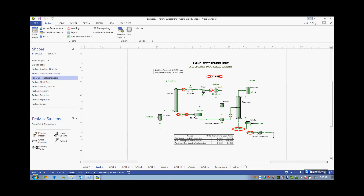Next, we have the steam and the lean amine, which are linked together because the amount of steam you provide determines the quality of your lean amine. You can tell Promax to provide the amount of steam needed to maintain any particular lean loading you like, or you can do the more traditional route, which makes the steam a particular ratio with the solvent circulation. In this case, we are using a ratio of the steam to the solvent circulation.